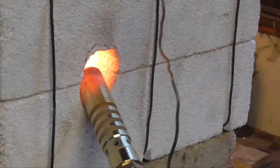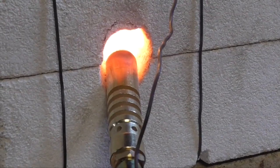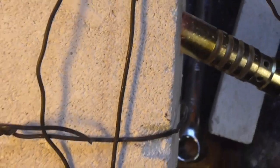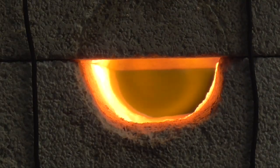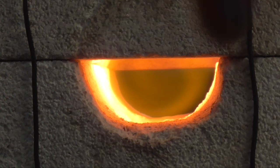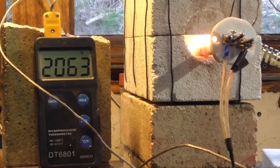Let's give it a go. You don't want the tip inside the forge — it's brass and it will simply melt. We want it angled slightly up and angled back like that. The angle of the tip causes the flame to swirl like a corkscrew towards the back of the forge, so instead of hitting one spot, it heats a whole section of the forge. Here I've added a pyrometer into the hottest section of the forge, and we see we've got it over 2,000 degrees — certainly enough to forge with, though too hot to heat treat. The torch has a pretty fine adjustment on it so we can turn it down.